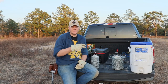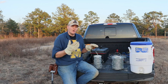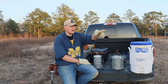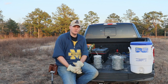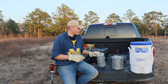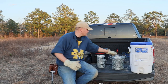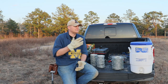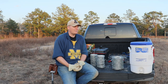We talked before about wanting to use Cattleman's 14-gauge 4-point barbed wire, and we didn't have any, so we used what we had. We came in with four big rolls and had about half a roll left over, which got us the first three strands. We have one full roll left, so I think we only used about two and a half rolls. You're going to end up with little guys that aren't quite a full strand. If you're not in a time crunch, you can blend these together tip to tip and keep going. Don't throw these little guys away — they're good for repairs. About three and a half rolls total, so about a mile worth of fence.